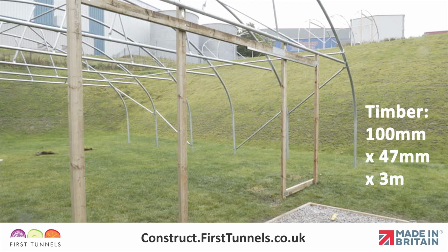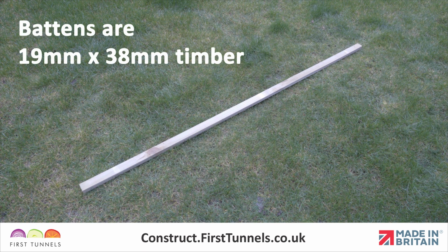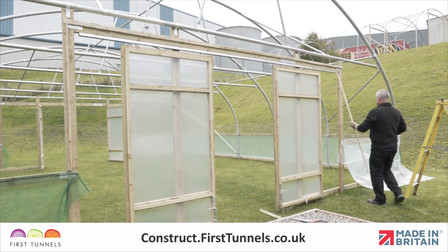The door frame comprises of 7 pieces of 100mm by 47mm by 3m timber, which are for the 4 door frame posts, the door frame lintel and the base timbers between the door frame posts. The remaining pieces supplied in the pack are 19mm by 38mm by 1.8m battens, which are used later when fitting your polytunnel cover.